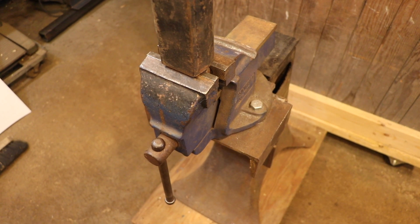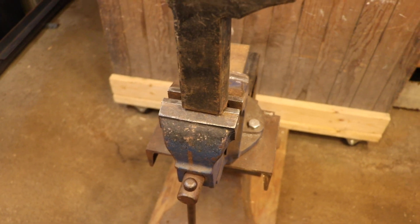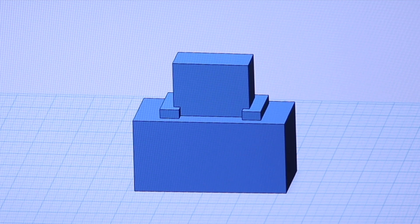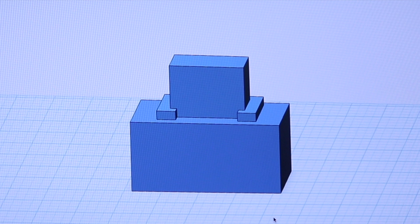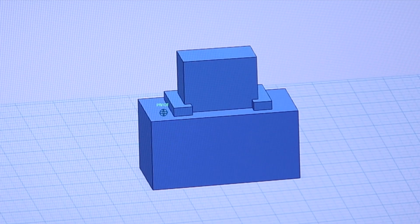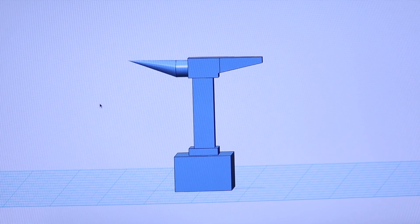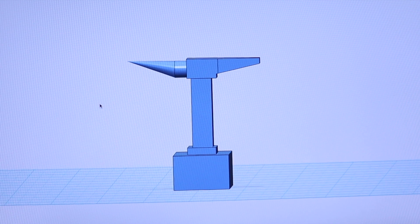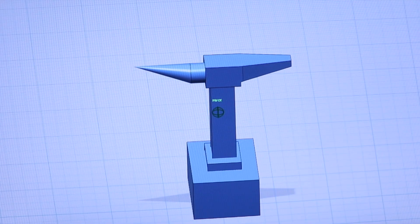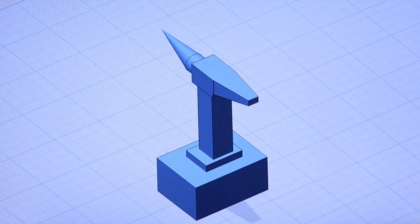So if all you can find is one of these big machinist vises, don't pass it up — mount it to a heavy base and a heavy plate and you have a system you can use to forge just about anything. You could put just a sledgehammer head in the jaws and you'll have a usable anvil. Anvils don't have to look like anvils — they just have to do the job. Looking back at the history of anvils, for probably well over a thousand years anvils were really just square blocks of wrought iron, representing the largest blocks that could be made and forged at that time. Any specialized work would have been done on stake anvils, which could be made with much lighter materials and were probably made by the smith himself.